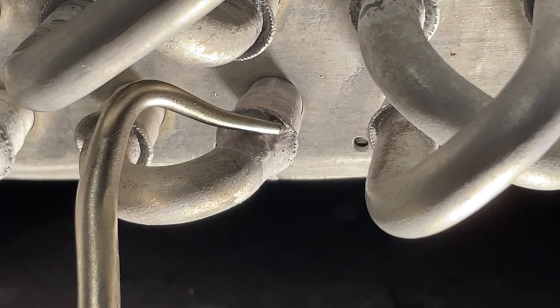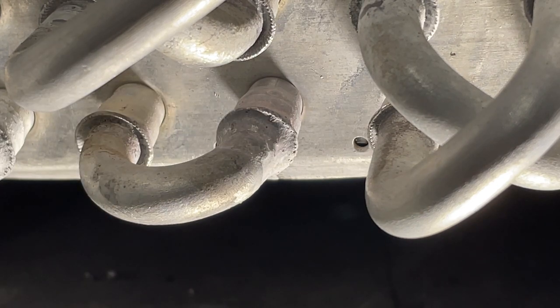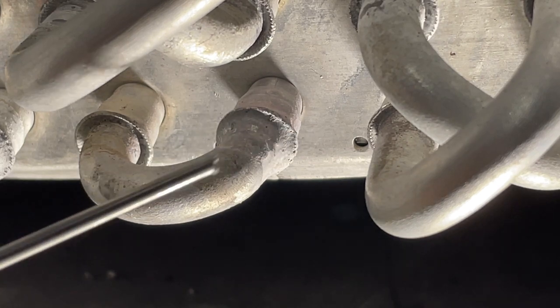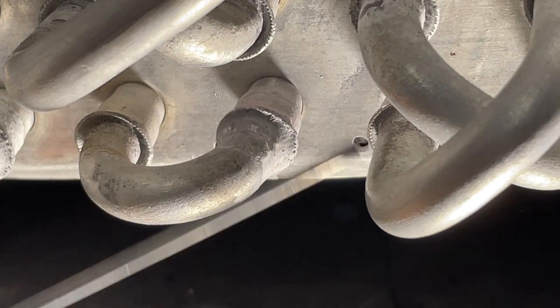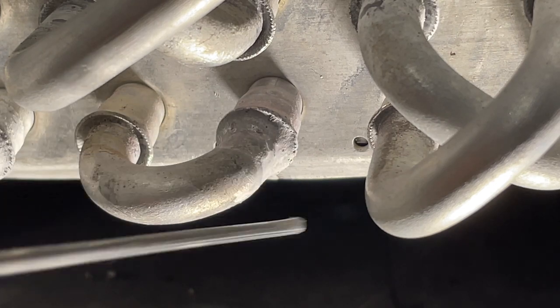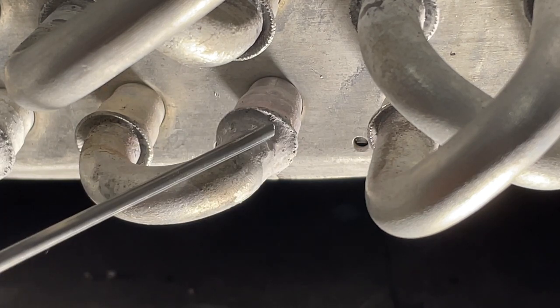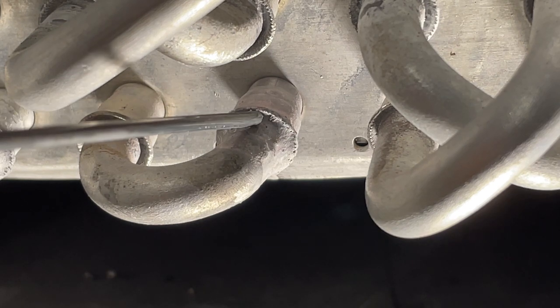Now, I might have a pinhole or two. That's just been my experience on braze in these. And if that happens, you just got to go back and re-braze it. But the extra flux really, really helps, because the problem with just a flux-core rod, if you can see that rod's hollow, is that you'll get up here in braze, but by the time you work your way down, this is already oxidized. So it's really nice to pack the entire thing with flux, and then it's just constant flux keeping the oxides off.